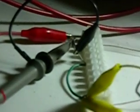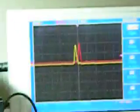Okay, so I've got the controller board running, driving the SSR boards, driving the same coil setup as Jason had in his videos. Some specs on it: flyback diode on there, to a scope that is floating ground with my EC600 power supply. And there's the input pulses.